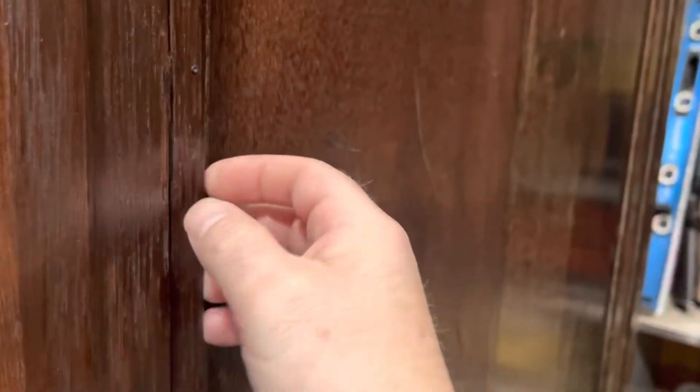Once I cut the 10 inches off, I'm going to square everything up, re-glue all the joints, and repair the damage. There's damage there, and this panel back here is coming off — it's separated altogether. It's just a lot of damage, but it's a beautiful piece. There's termite damage there, but I've got oak so I'll replace it. These are just panels, and it's been stained two or three different colors.